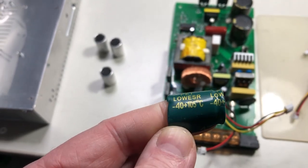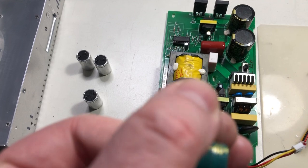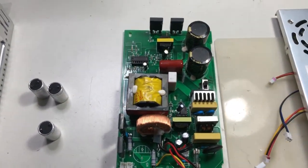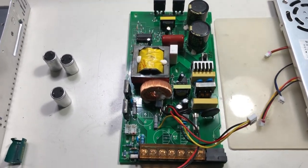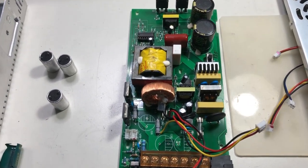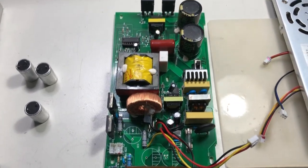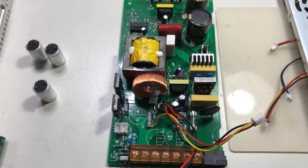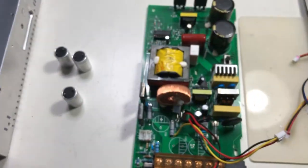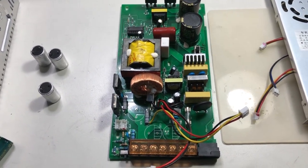The brand is GC Con — I couldn't find anything about that. They're labeled 105 degrees, low ESR, 47 microfarads. Anyway, I know that most of these capacitors are repurposed, reused, just pulled from scrap old PCBs and put a new sleeve on. I have no problems with that as long as it works and is not getting dangerous.